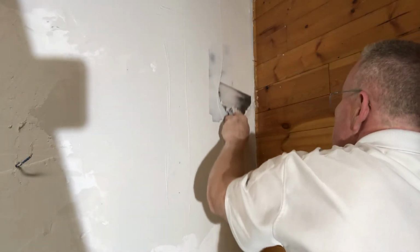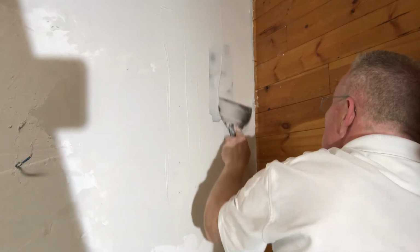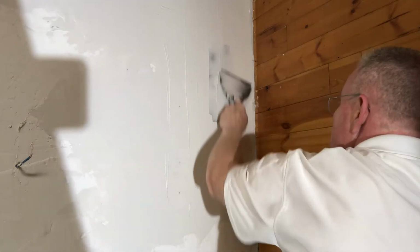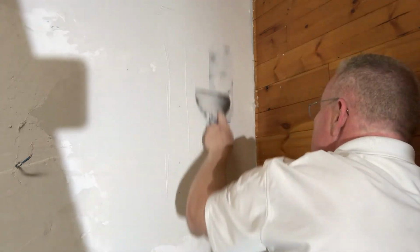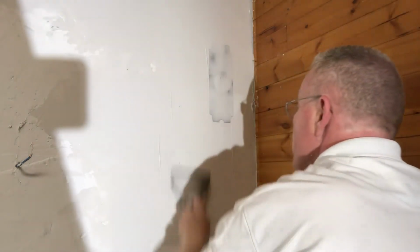I'm telling you right now, this repair is far stronger than sheetrock, because you have a thicker amount of gypsum in the middle, which is plaster, and then you have a mixture of nylon and metal, this screen here. On the inside, you've got the fiberglass. So you could hang something on this quite easily with a nice nylon anchor. So there's our repair. Let's bring you up close to it, making sure that the whole repair is in. See that? And when that dries, you might have to hit it 2 more times with very thin coats of joint compound.